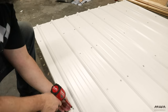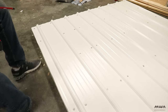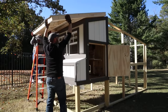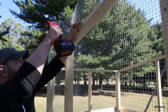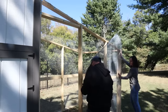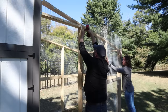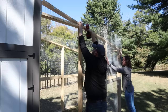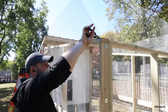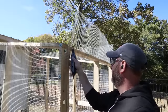For the roof I went with metal instead of shingles. Compared to shingles, metal is much lighter, stronger, and quicker to install — no plywood underlayment needed, just screw it straight to the frame, and it's easy for two people to lift into place. Before installing the roof over the run, I covered everything in hardware cloth, which is much easier to deal with while the panels are still accessible. In hindsight, I'd install hardware cloth as I assemble each wall while it's flat on the ground. Hardware cloth is like a stronger version of chicken wire — more secure but a bear to handle solo. I started cutting it by hand but quickly switched to a rotary tool with a metal-cutting wheel.